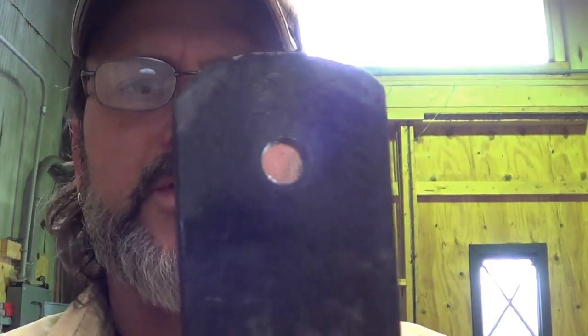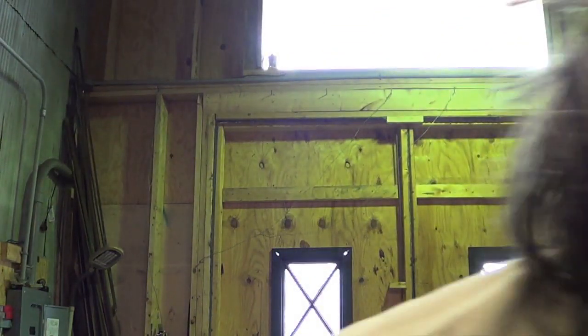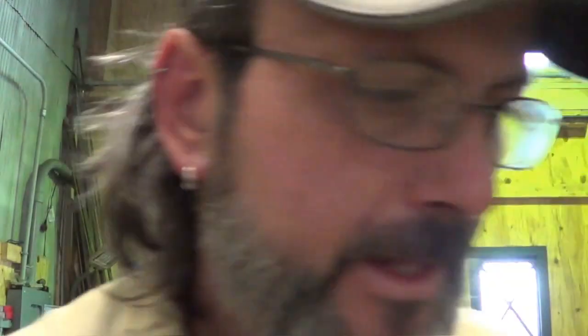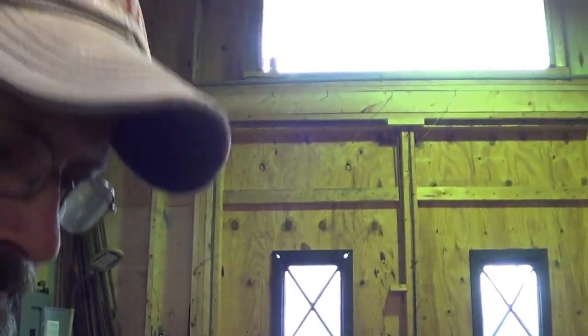All right, a little time on the drill press, a little time on the grinder, and I got the basic shape that I want. I can finish the rest off hammering. Put about a 3/8 inch hole, and that'll allow me to get a little distortion. I want a little distortion as that thing gets drifted out. So I like the way that looked. And again, what I'm really doing right now is reproducing pieces that I can use to fit the arms when I'm done. So I need to do it the exact same way. So we'll get over to the forge and we'll drift these things out.